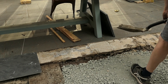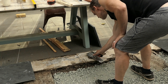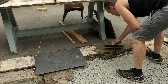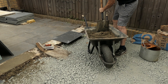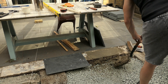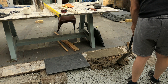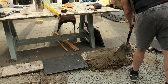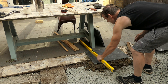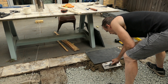First of all I'm going to start where I've taken the half tiles up as this will determine the height to follow. I'm putting a very thin screed of mortar on top of this section, and then I will shovel about four centimeters of mortar onto the scalpings. Then I'm going to press them firmly in place and check the level. I'm making sure the mortar is firmly packed in.